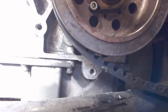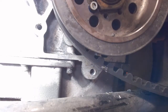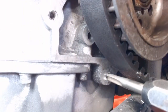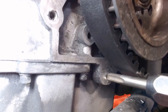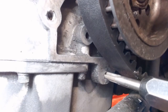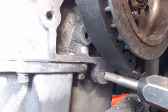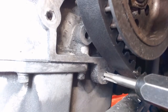We're going to take our starter tap and put it in our tap wrench. So we got our tap right here and we're going to start this in here. If you're new to this: you start with three-quarters of a turn in, then a quarter turn back out — that quarter turn back out will break the chips off. Nice light touch, make sure it's nice and straight. Take your time with this. Okay, there we're biting in. Three-quarters of a turn in, back out a quarter turn to break the chip, then go back in to where you stopped and three-quarters of a turn more, back out and break the chip. Keep doing that all the way in there until it bottoms out.